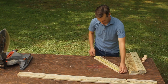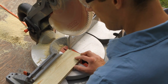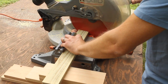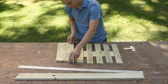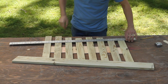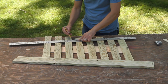To get started, use your miter saw to cut the pickets down to a rough length. Then for the angled tops, adjust the blade to 12 degrees and trim off one end of each piece. Now there's a trick to marking the right length: lay out eight of your rough cut pickets using spacers to keep the distance between them even, and line up the angled ends against a straight edge. Then use a straight edge at the other end to mark a line across the bottom of the pickets. Once they're marked, set your miter saw back to 90 degrees and trim each piece.